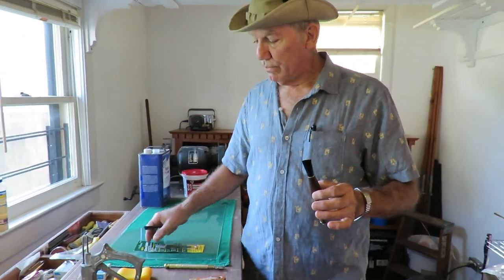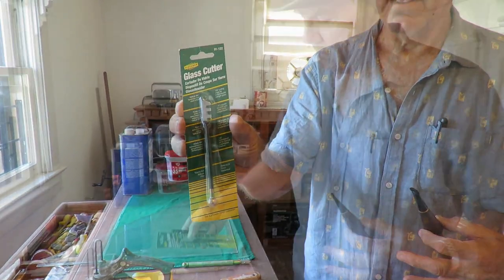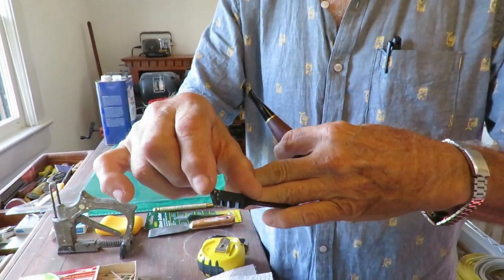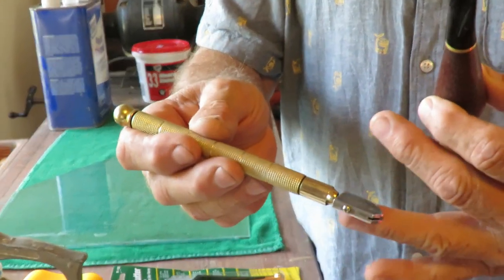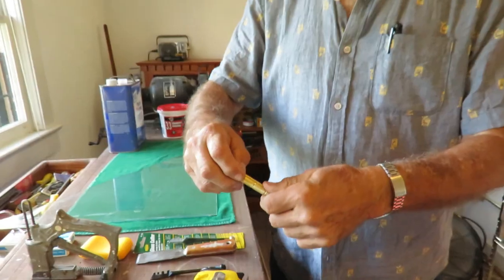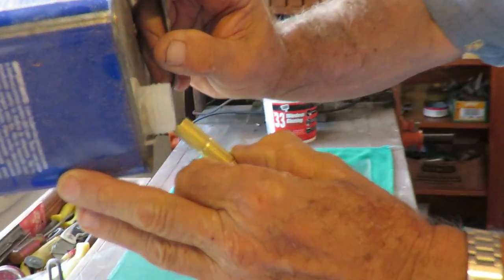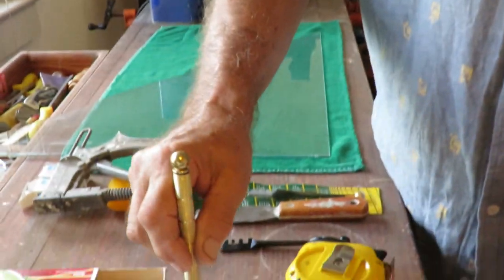Welcome to today's lesson — a treatise in glass cutting. Most of you would be inclined to go to Home Depot or Lowe's and get a glass cutter that looks something like this. Both consist of a little carbide wheel that rotates on a pin. If you really want to go upscale, you can get something like this — the tip actually swivels. The unique feature about this one is that you can fill it with paint thinner; there's a little valve at the bottom.